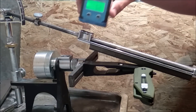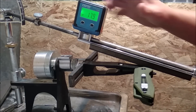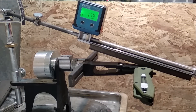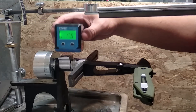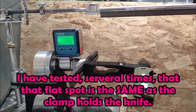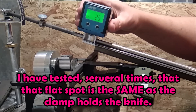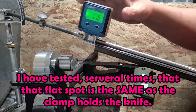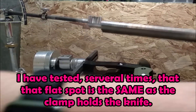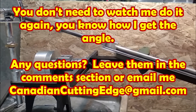Then I want to measure the angle, so I put it back on there and we are at 17.9 degrees — you can see that. Just to verify again, if I go put it back here it should go to zero. There you go, it's zero. So this angle on this side is 17.9 degrees, and then I do the exact same thing on the other side — 17.8, 17.9.